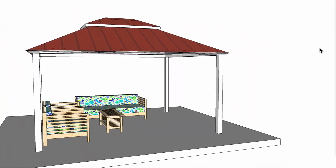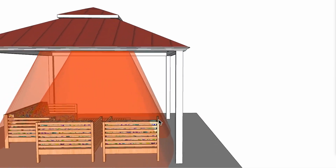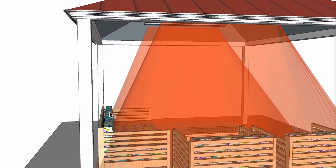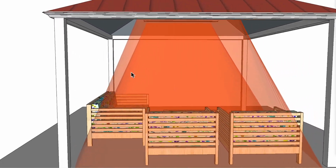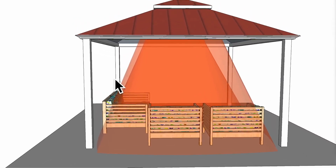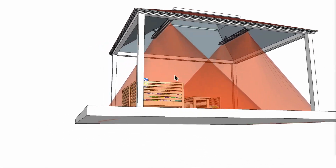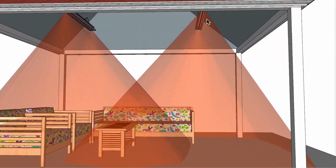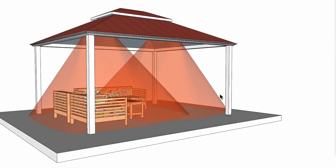And over here should be no problem whatsoever, except there's a little bit of space that's not heated 100%, which you can see right here in the corner. And then of course back here, if you're all the way to the back of this post here, the cushion chair, etc., back here your head's going to be out of that heat. But I'll tell you, this is infrared light waves, so light waves do bend and stretch as they travel further through space, and you will feel the warmth over here. It's just not as intense as the 6,000 watt units, and at this elevation here, it's really designed for almost a perfect application. Again, you can see the slight angle change here. I think I have it at 5 degrees tilted in, and then this one 5 degrees tilted in this direction here. So that would be my preferred application.